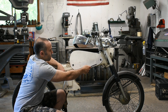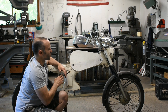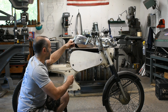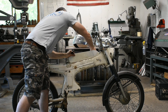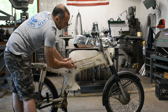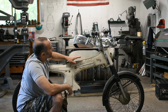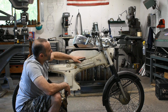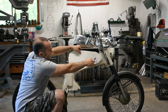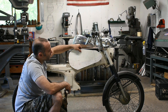On this bike, we'll note back here — this is the height of the tank mount, so mark 'tank mount.' This tank has a body line that's going to be in it, so that's this black line here. If you do it at home, you want to be clear about what each line means. Also, an important thing to note is to go on the back side of this pattern and mark the top of your frame, because I need to know how deep to make your tunnel. We want this thing to hold as much fuel as possible, so mark how deep I need to make your tunnel inside the side profile.